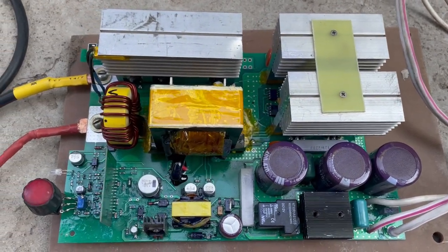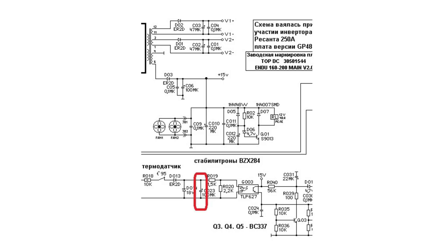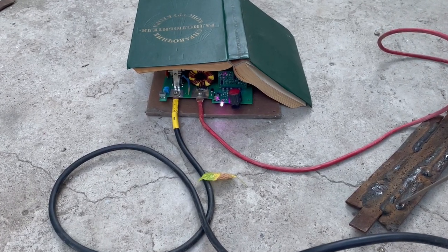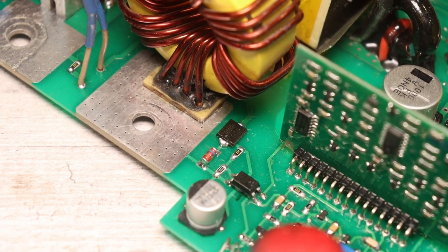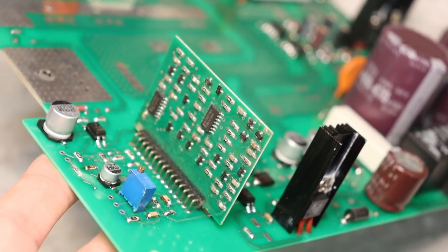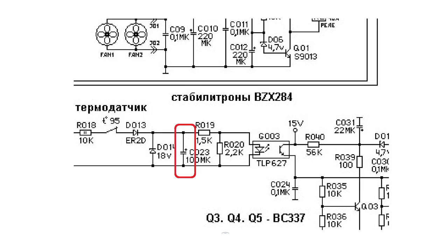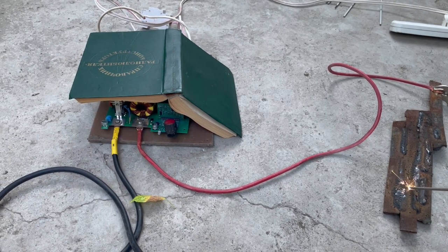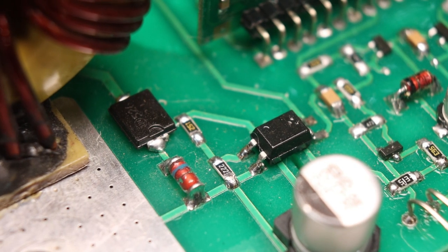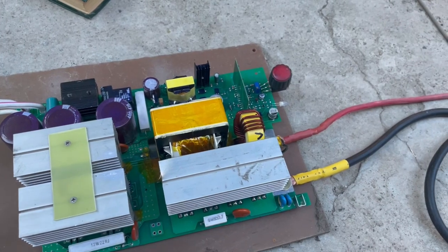The output voltage from the inverter through a resistor, terminal switch and diode charges the specified capacitor. As soon as the voltage on it reaches the threshold of the LED of the optocoupler, it will light up. When the electrode sticks, the output voltage will decrease sharply and the optocoupler LED will go out. The specified circuit, having seen this, will after a short delay give the command to the control system to reset the current so as not to heat the electrode. The same thing happens if the terminal switch trips. An important role is played by the storage capacitor, because after sticking the control system will work after a short delay — this delay is provided by the specified capacitor temporarily feeding the optocoupler LED, thereby giving time to ignite the electrode. The larger its capacitance, the longer the protection response delay time.